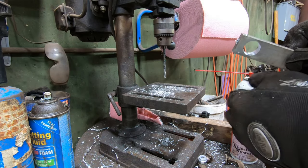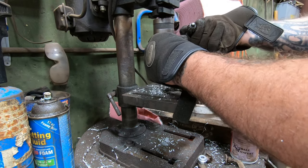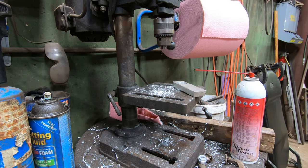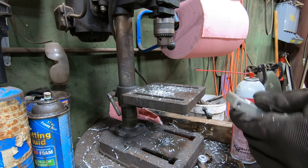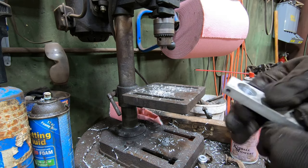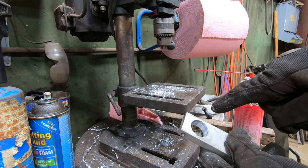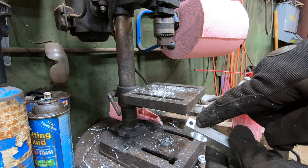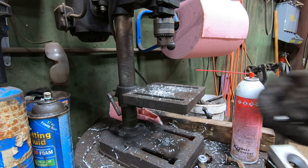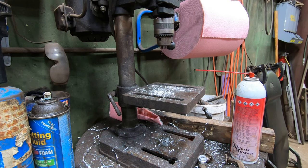Alright, so there's that. I'm going to cut it first — cut it right down the middle here so I got a relief to squeeze. Then I'm going to drill halfway in here to make it a little bit bigger and run a tap through. And then I'm going to drill this size big enough for the cap screw to be recessed in there like that, same way we did with the bottom section.